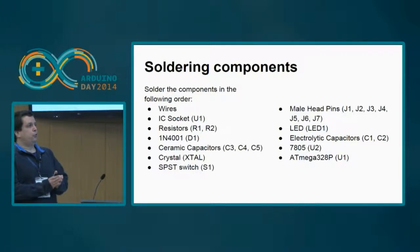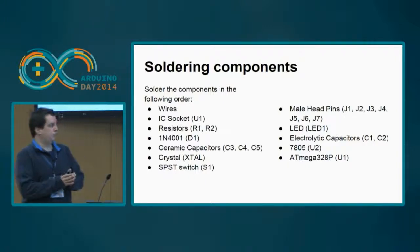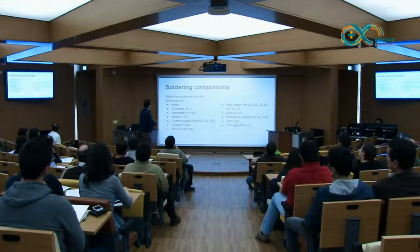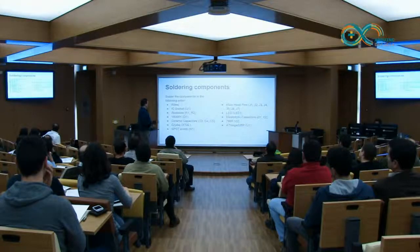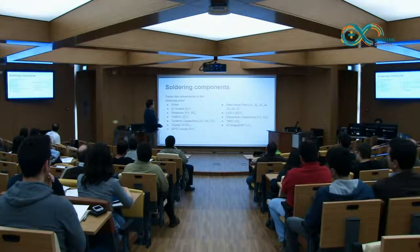There is a method for soldering the components in a board. This is a general recommendation. You should start with the smaller ones, the ones that have no or little height. So we are going to start with the wires, then we are going to solder the IC socket. Then we put the two resistors, the rectifier diode, the three ceramic capacitors, the crystal, the switch, then the male header pins. They are typically a little bit higher than the rest, then the LED, the electrolytic capacitors,